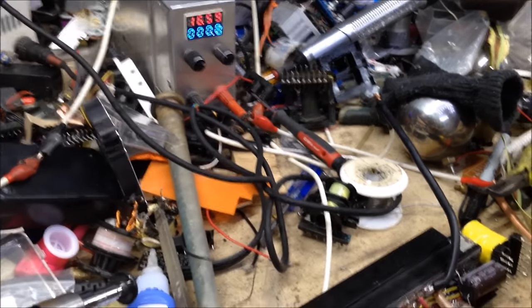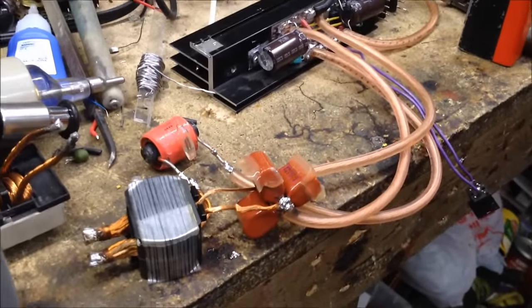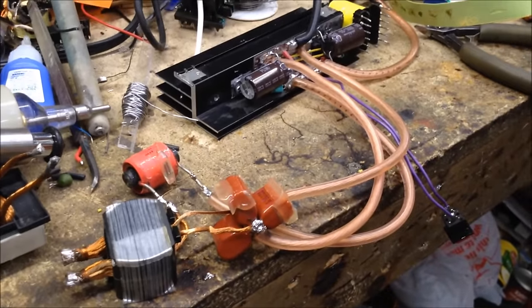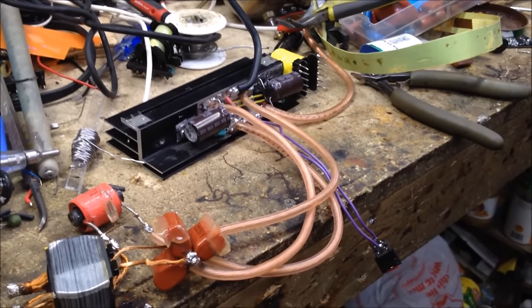Well, that's because this sucker is 6 volts. Well, that's because it's clamping at 10 amps. So basically, the way I designed this circuit in my head, it should draw 30 amps. It should oscillate around 10 kilohertz. So you need more current. Yeah, but I didn't expect the supply to be able to juice it, and it should run off a 4S battery. Do we have one of those? Yeah, we do. Do we want to do that?